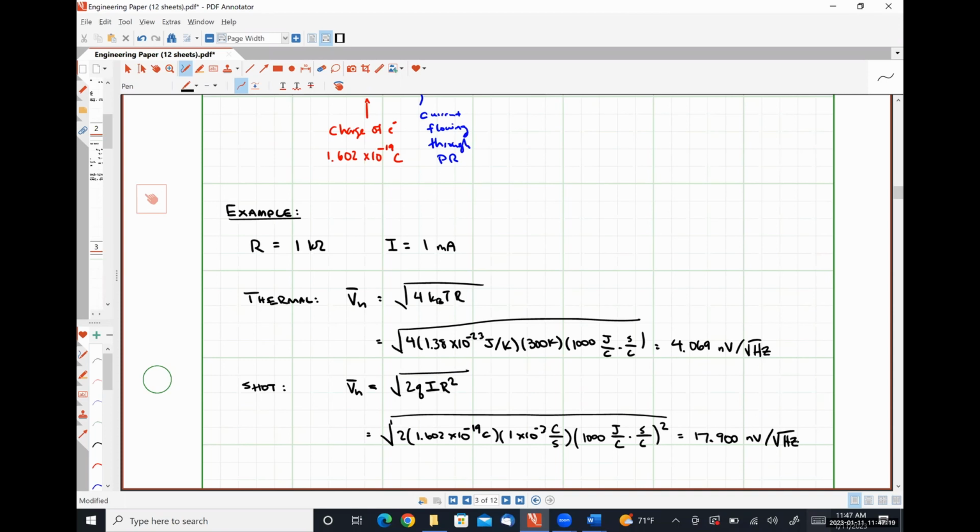Well, as we dope beyond that 10 to the 17 threshold, our piezo resistive coefficient goes down. So the portion that would be acting as a wire, its resistance is going to change less due to the piezo resistive effect than the resistor part will. So we also won't have a contact potential to speak of, because we don't have a difference in materials that we are overcoming. So if we make our wires out of the same semiconductor, just using a different doping concentration, we should see that our shot noise is effectively non-existent.